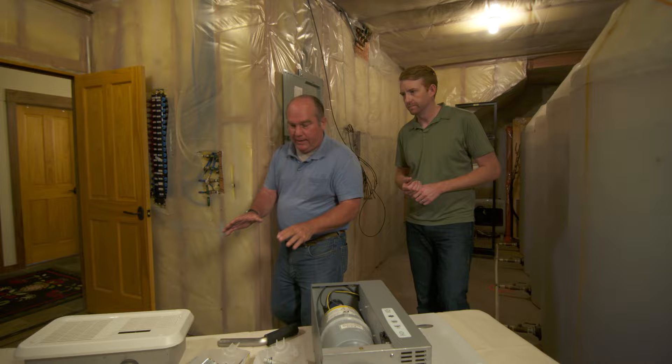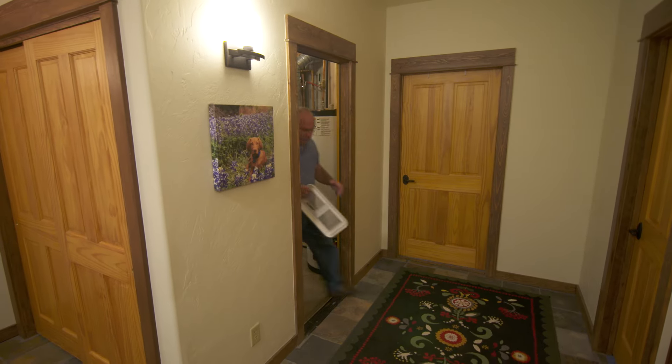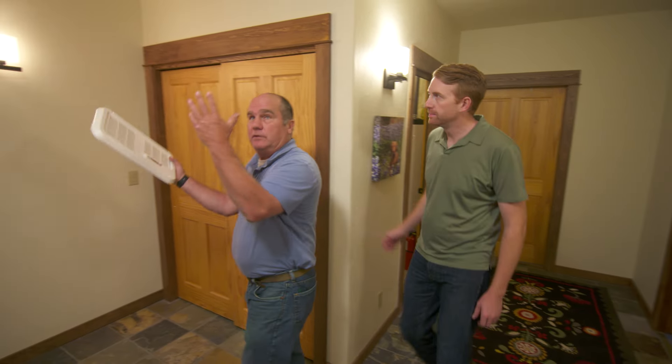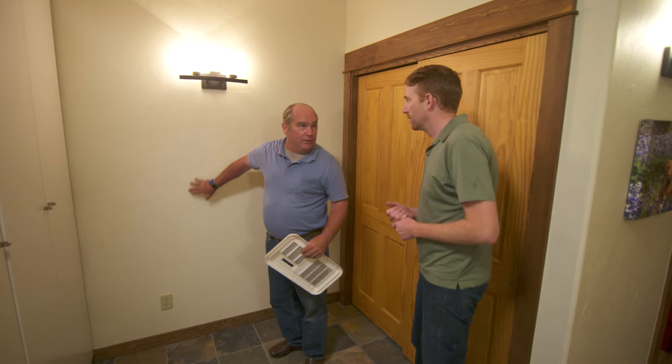The other component we have to think carefully about where we place is this fan pack — it has to be in the right location inside the conditioned space. If we introduce humidity into the space it'll equalize through the whole building even without ductwork. So in general, right behind the mechanical room here is a perfect location to introduce humidity.